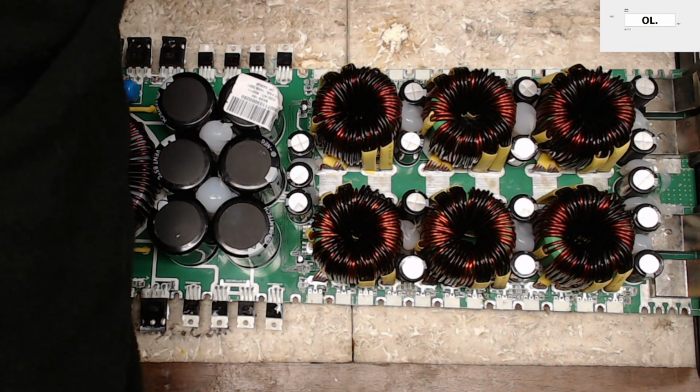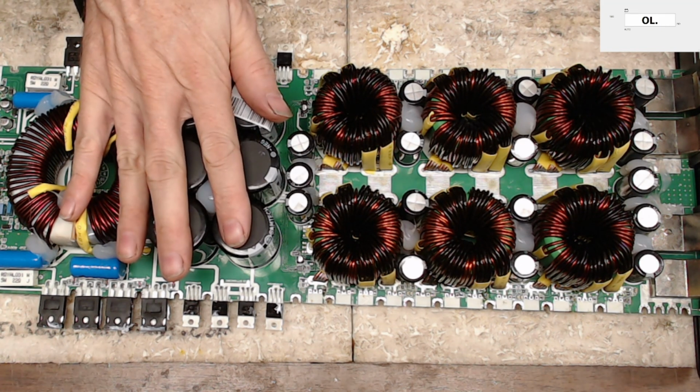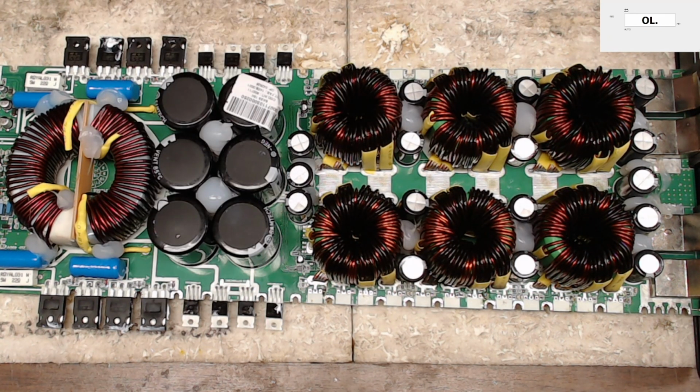And see if this agrees to give us any form of signal. I'm not worried about voltages, because without power supply transistors you cannot have rail voltage. So I'm just looking at the lights. And I do get a blue on light. So I should have drive on.